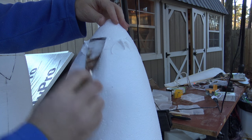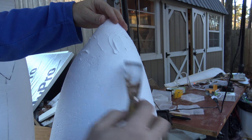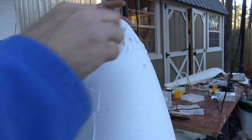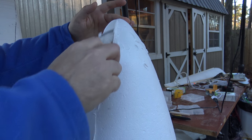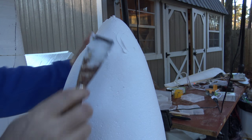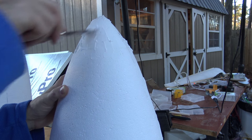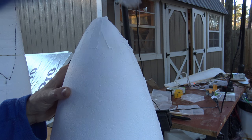I'm taking the one-inch trowel and just applying spackle because when you start to get up near the top — the radome — using a smaller trowel is just a little bit easier. It's easier to contour the very sharp curve that's up towards the nose. This is where the curve really starts to come in — it all focuses right in at the tip.